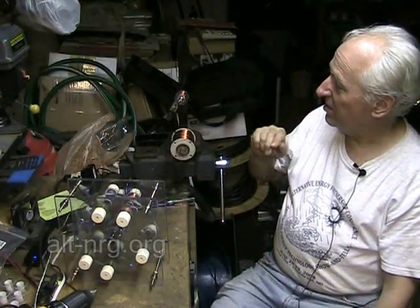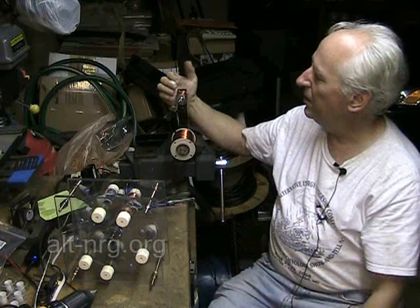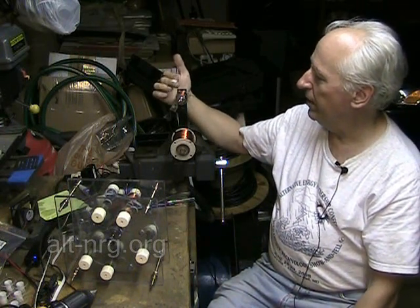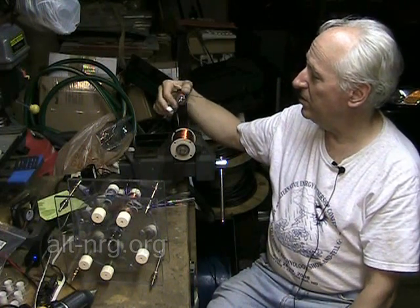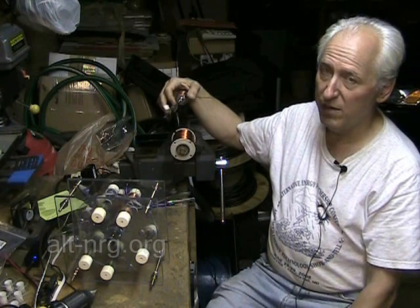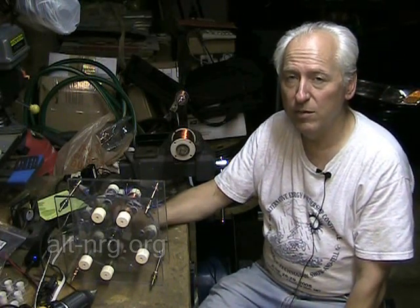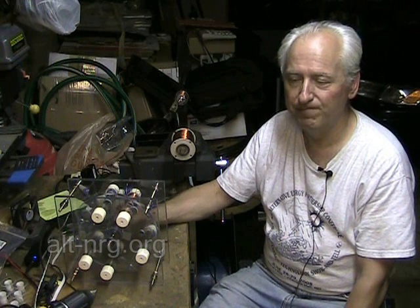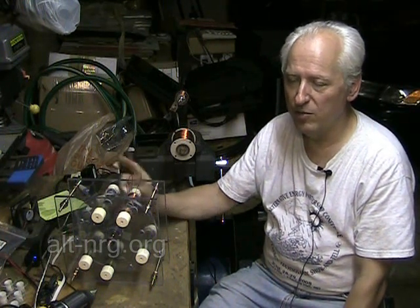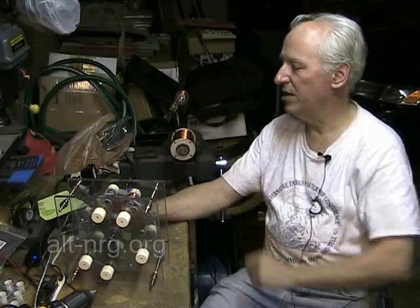I also wound a different type of coil this afternoon. This coil has 160 turns, whereas the Müller coils have 97. This is just a straight layered coil where I layered it back and forth on the coil winding jig. My first attempt at winding this coil failed because once I took it out of the jig, the end of the bobbin wanted to pull right off because the windings were compressing. Somebody in the JustinTV live chat room suggested I look at a YouTube video where a gentleman showed he wound his coils for a wind turbine dynamo — winding two layers, putting three strips of five-minute epoxy, then continuing with additional layers. Every two layers he would put three little beads of five-minute epoxy. That's what I've done, and we'll see how that holds together.